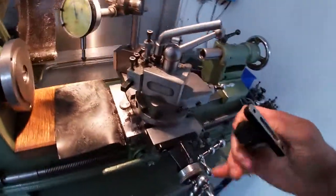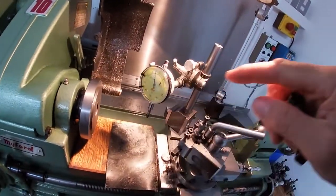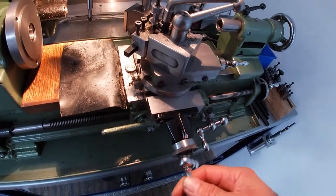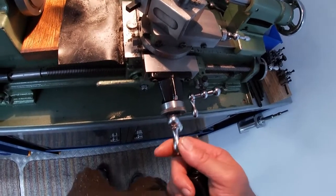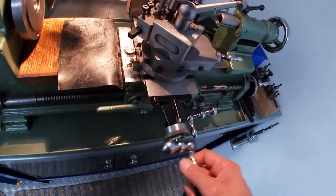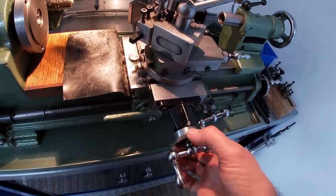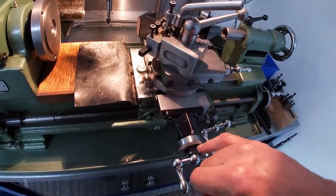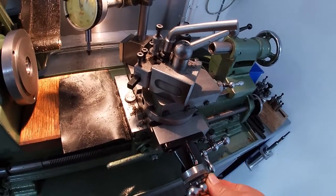On the other side the other bearing goes in and does the same. The existing shaft goes through here and then you can actually tighten up on the bearings because the more side thrust you put on these, it's a much much gentler curve. So you can get this to a point where it is actually nipped up on the bearings and there is no play. As soon as I move that backwards and forwards there is no perceptible play. If I were to DTI that we would see it move — so there's no play in there and I'm really happy with this. As well, the other modification was adjusting the friction rate by skimming off a small amount on the inner bush, so that the Belleville washer would allow me to set this without losing my adjustment.